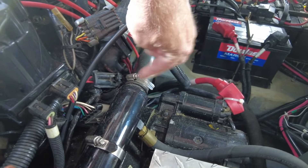Looking back here on the starboard side — same thing as on the port side: the other rudder shaft, which helps turn the boat while underway, with the connecting rod and everything else. Sorry, that's just the air conditioning pump coming on. You're also going to see a bunch of green wires attached to pretty much everything metallic — those are bonding wires, so everything is bonded together. Very, very important to protect all the brass components on the boat from deterioration due to electrolysis.